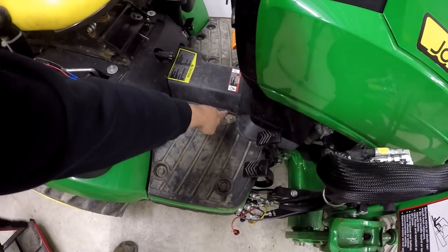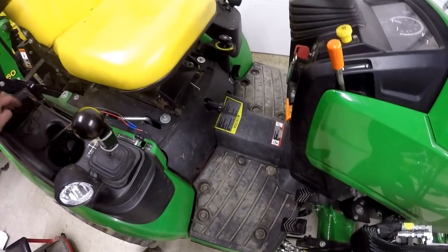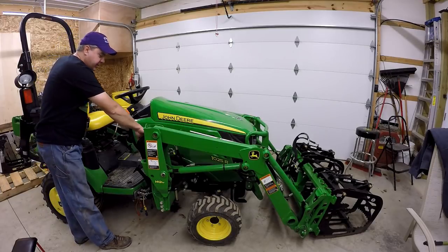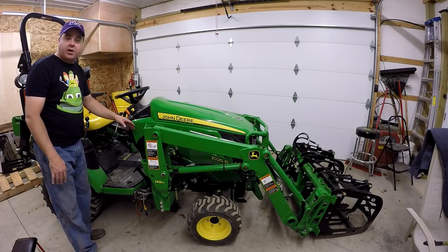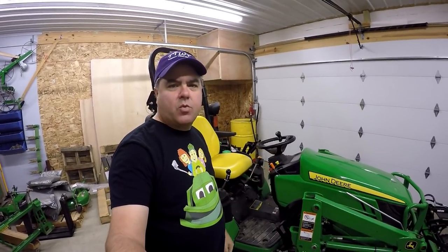You can probably see the wire. I got to hide it right under the rubber there. Route it around here and then let it come out. Get it all plugged in here. Every time I test it, we should be able to hear it and actually feel it right here in this solenoid. So that's when you know it's working. You can do that test all along once you've got the wiring done just to make sure that your wiring is good. Let's see, where were we now?